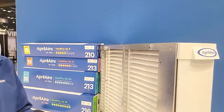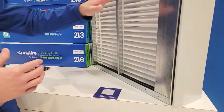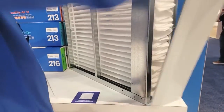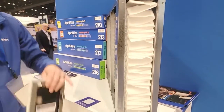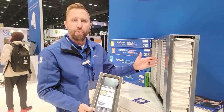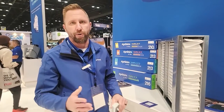With our filter cabinets, we ensure that you're filtering almost 100% of the air going through it. We have a sealed rail system on the top and bottom, and on the front there's an overhang that seals against the door along with gaskets. That way, we're forcing the air through that filter — because air naturally wants to go around it, so we create that force field of filtration.